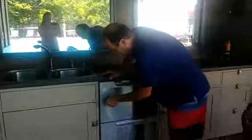Another thing you want to do is make sure that your gaps around an appliance don't let you have entrance up into here for bugs or other types of varmints that might get in there. So these cabinet sides are made to fill in all the way up to the counter, and that's sealed in there before this dishwasher was installed, before the refrigerator was installed. Everything is sealed just a little bit better. So using that waterproof MDO type plywood, having a lip that these doors can seal against, you can see all the way around. This has got this lip all the way around here. This door will seal right into that lip, and it keeps it well sealed off. There's not gaps in here where you can see things through.